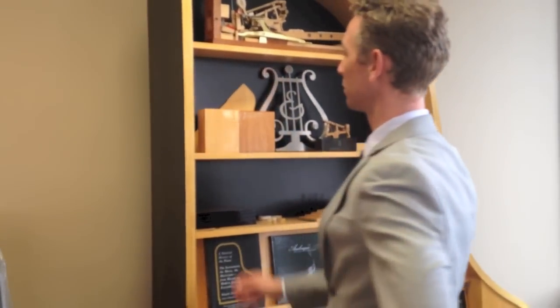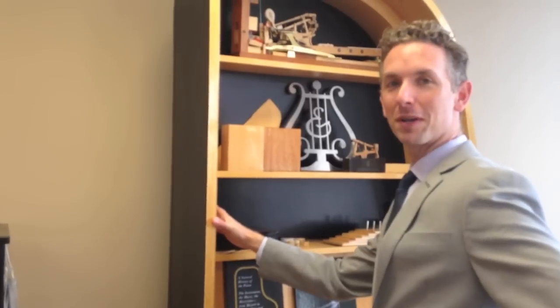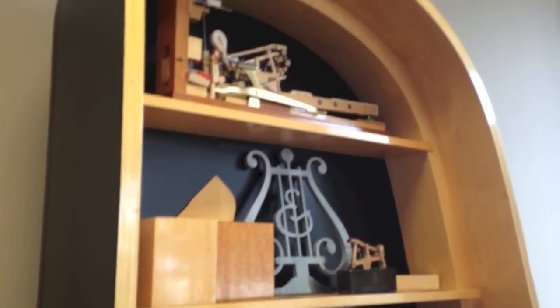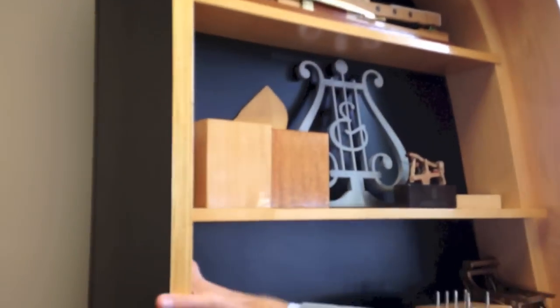Tell me about this case. This is the rim of the seven-foot Model B and we make it out of hard rock maple. If you come closer, you can see the laminates of the maple. We have these in a specific room at our factory controlling the moisture content per square inch. We bring these boards out one at a time — we bring out the outer rim, glue it, put the next one down, glue it, all the way to the last inner rim. Then five or six people bring it around a big metal piano-shaped device in the middle of the floor, clamp it into place — that's how we get the structure and foundation of our piano. It's one of the reasons our pianos can last 100 to 150 years.